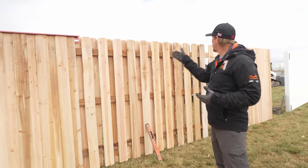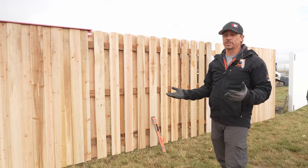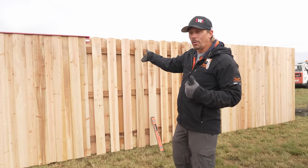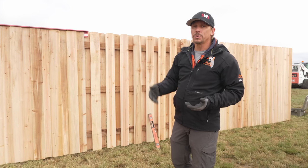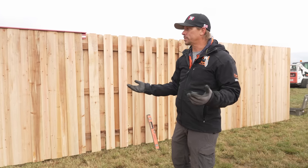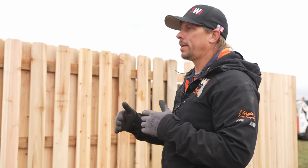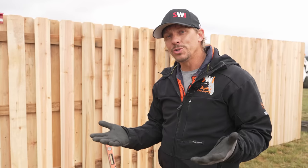So now that we've showed you how we use the straight topper to do our regular stockade fence, we've shown you the value that it has to do board on board as well as shadow box, which are all very difficult fences to do if you don't have a tool like this to help you with all the math and get your picket spacing correctly. The time savings alone that you pick up just from being able to do all those various types of fences is huge. If you have any one of these projects coming up — a board on board or a stockade — I would highly recommend picking this up, even if you're a homeowner, because it will save you so much time. If you're just doing stockade fence, maybe build a jig or perhaps you still want to use a string line. It's worked for a lot of years, it's just a lot slower — so know going into it that you could have the problems that Dan had, where your string will creep up and then your fence top isn't straight. Are you ever going to do another wood fence with a string? I think if you were taking the time to do it right and make sure your tops are even, it probably would have added another 30 seconds pretty easily. And then if you're rolling down a hill you'd have to have more time, removing the picket and putting your string back down to it — it just adds a lot of time that I don't have to take with my straight topper. I can just run boards all day long. The question you need to ask yourself is what is your time worth? Have you ever ran two of those at once? Yes, we do it all the time — every truck that we have in Florida has two of them on it.